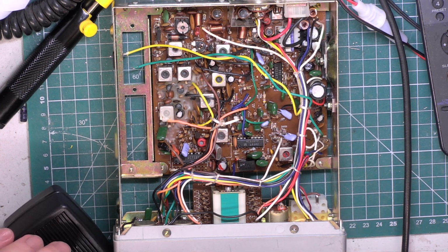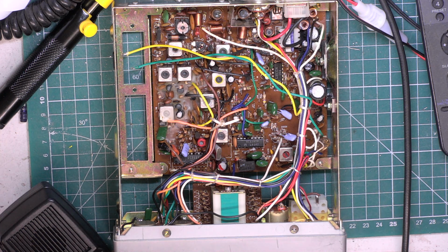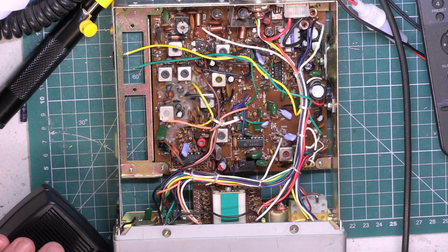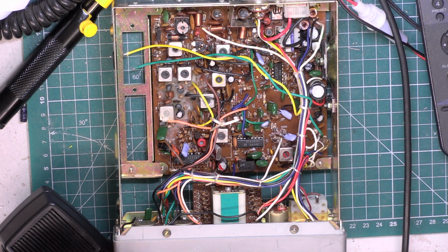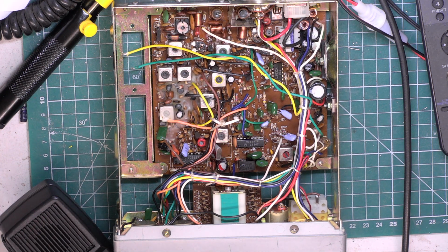So for 20 dB, it's still 1.3 microvolts, but we have increased the sensitivity dramatically. So let's look at 12 dB to be fair, because that's what we're normally working on. For 12 dB, the radio is doing 0.5 of a microvolt. It was doing 0.6 before, and for 10 dB, it's doing 0.41 microvolts. So that's 0.3, which we can hear. We can hear it down to 0.15 of a microvolt.